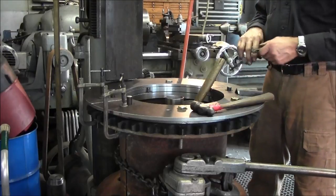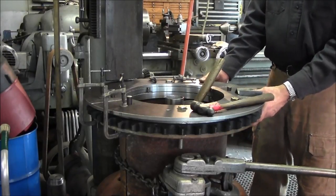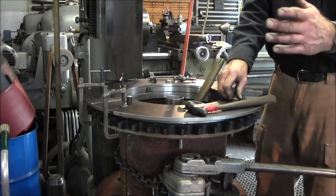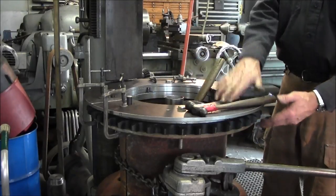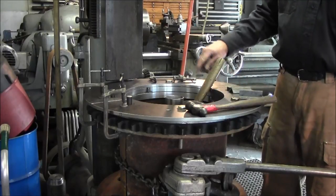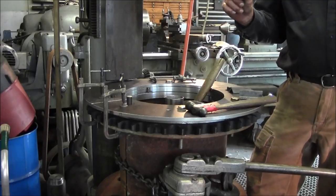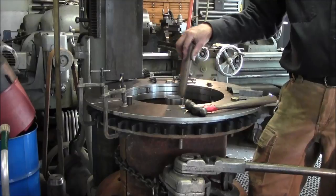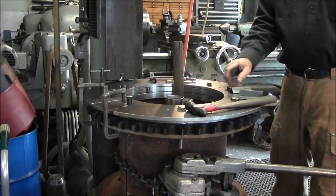Okay, what I'm gonna do now is with this under tension, I'm gonna go get big clamps. Actually, what I'm gonna do is, I keep changing my mind here. You notice that? All right, these four are bolts. And if we tighten and sandwich these four right here, we'll be able to tap these four out here and run the reamer down through there. We know that we're within, I don't know, 30 thousandths, total 15 a hole, when I eyeball in there.